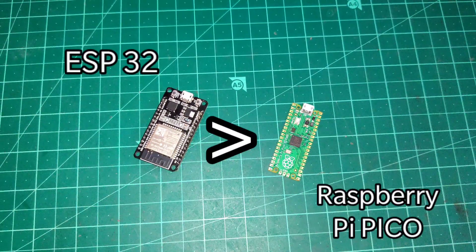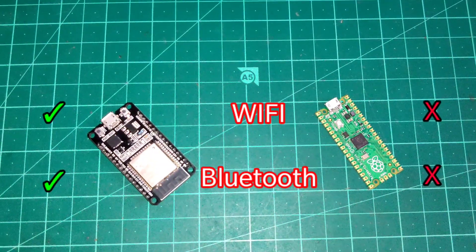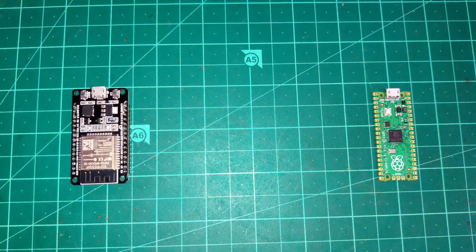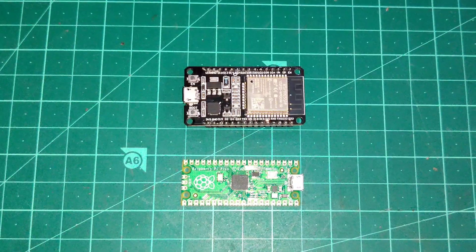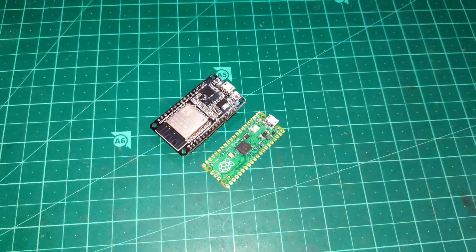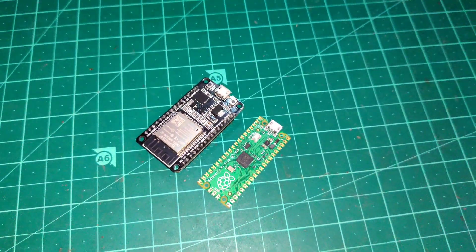Talking about ESP32 — yes, ESP32 beats Pico in most scenarios. ESP32 has Wi-Fi and Bluetooth, is clocked higher, comes with more memory, and supports I2S and CAN, which makes it a better device than Pico. But the USB 1.1 host and device support and HID support give Pico an edge. To be honest, in most projects we don't use features like high clock speed or more memory. So in those scenarios Pico will be as good as the ESPs. But it's gonna hurt when projects need Wi-Fi or Bluetooth connectivity — the lack of those in 2021 could be the downfall of Pico.